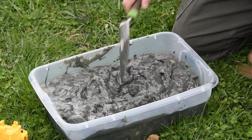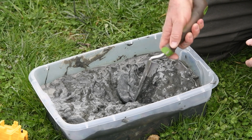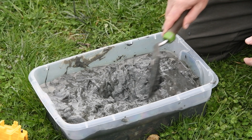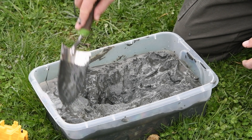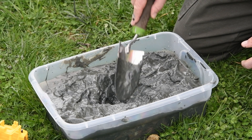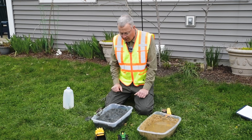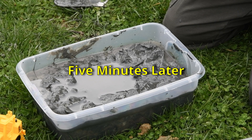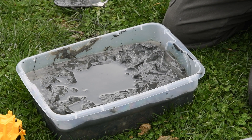We're going to reshape the surface of this groundwater-saturated area and see if we can make a wetland. I'm creating a shallow depression in the center, digging down deep enough to see through the organic soil and into the mineral soil. I'm shaping a wetland basin that is deepest in the center, then spreading the removed soil to form gradual surrounding slopes. I can see water seeping into the bottom and from the sides. We're going to wait a few minutes and see what happens.